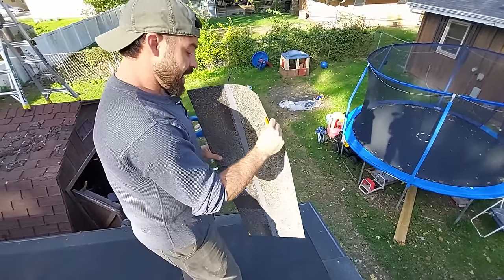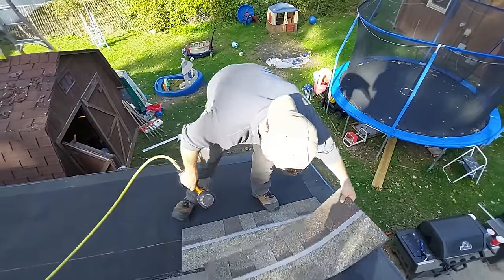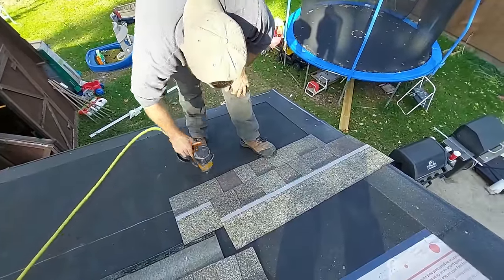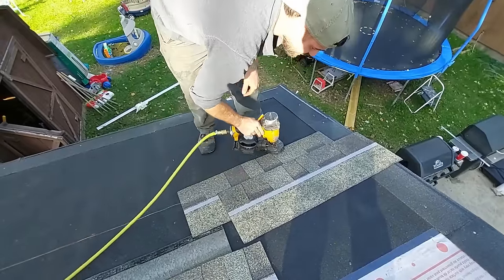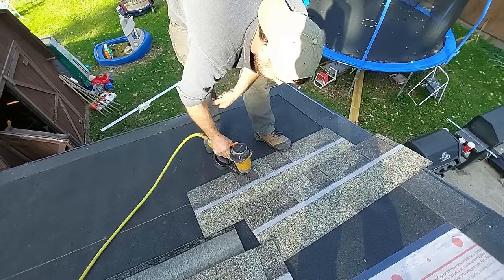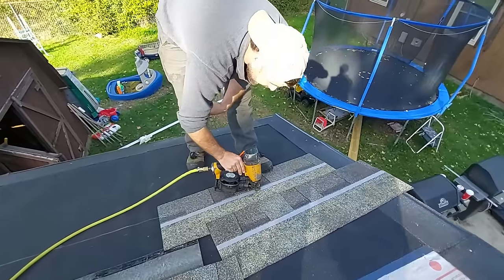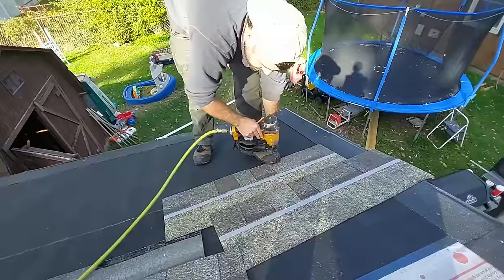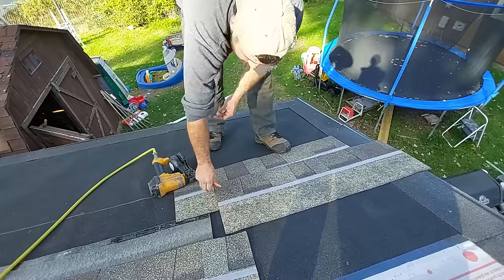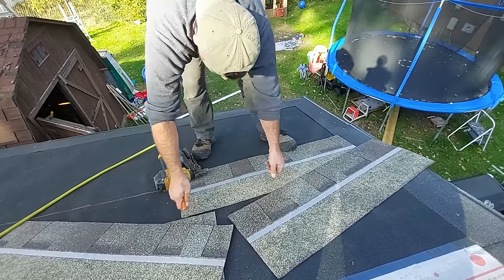So that's really all you have to think about when nailing, aside from some other things, like you don't want to nail where a seam is going to go. We're going to be staggering our pieces about 7 inches or so, which means we don't want to nail right here. So we don't want to just start shooting nails right off the bat. You want to put one nail 1 inch away from the end and then skip over just a little bit past that, about a foot in, and then start nailing it. Okay, you don't necessarily want to shoot one on the end and then skip all the way to half the shingle and then only shoot half the shingle. You just want to skip over just a little bit, okay? Because like I said, when you butt two shingles together, water does get in this groove still and it will work its way sideways. So you just don't want to nail close to it.